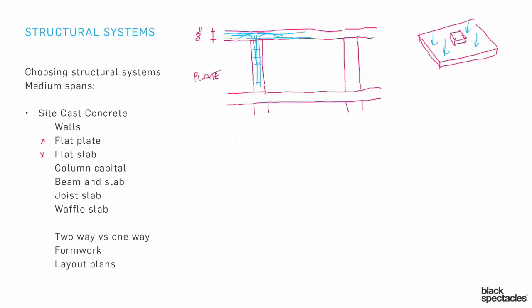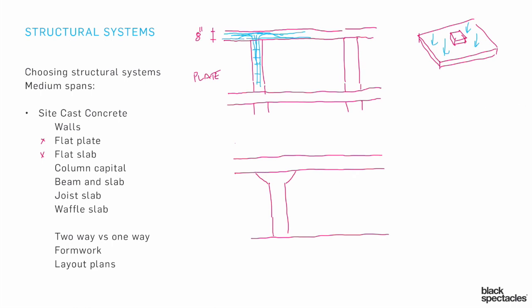This is the flat plate. Then there's the flat slab version — I have that same slab, but I add a column capital to help that transition of all that rebar. Instead of having just that really tight space to fit all the rebar going from the thin slab into the column, I now have this extra zone. The rebar has more opportunity to find its way down. It also ends up reducing the effective span — from a deflection standpoint, the overall span is quite a bit less, because you're measuring from the column capital edge rather than the edge of a straight column.